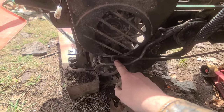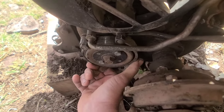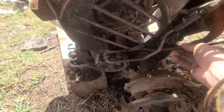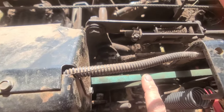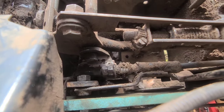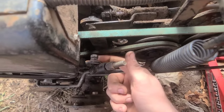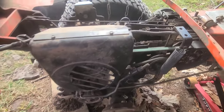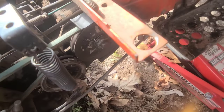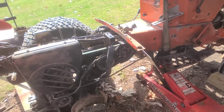It's another day. I was going to try tightening it up - that still needs to be somewhat loose, and this one needs to allow some play and pivot. I checked my park brake adjustment and that's good. I can check my belt tension right here. I added a compression spring just to knock down some of the noise. When I step on the pedal that spring will collapse, and if I step on more it'll de-clutch. I put a second jam nut on this to keep it from rattling loose.